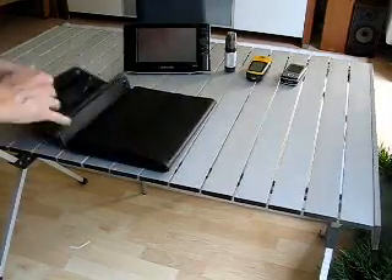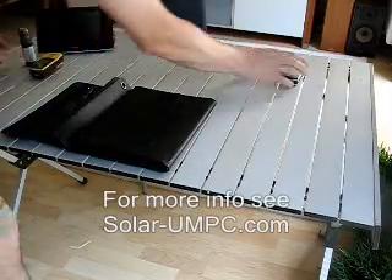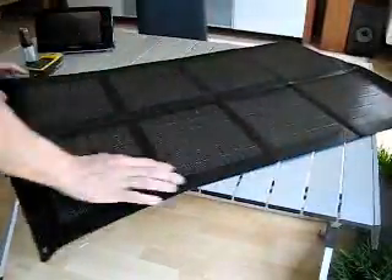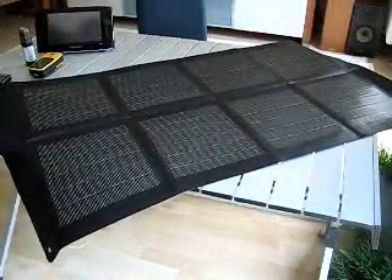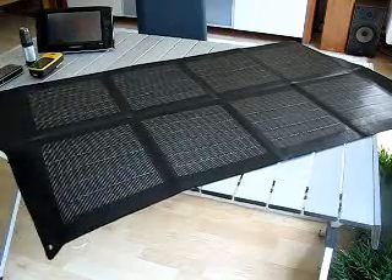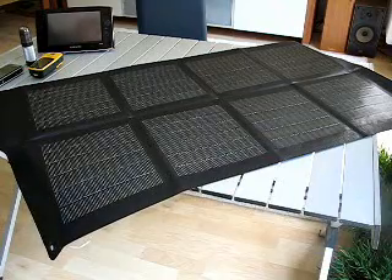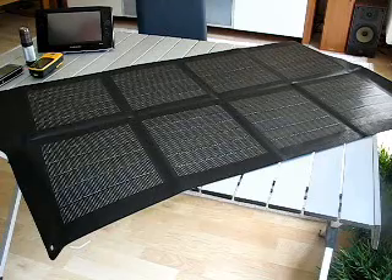Here's the solar panel — it's a Sunlink 25 watt, 12 volt solar panel. It's on a rubberized sheet with four main solar panels and an output connector. 25 watts is the maximum output energy of this device, so that means only when you're in a midday full sun situation are you going to get that amount of power out of it.